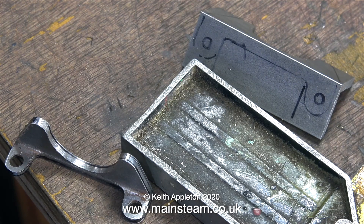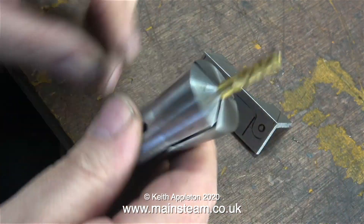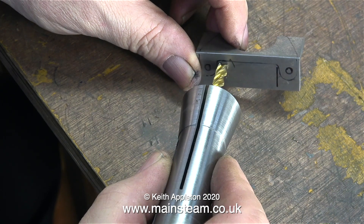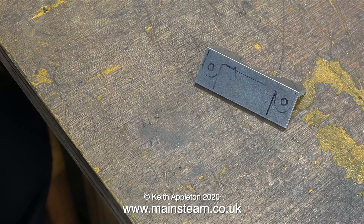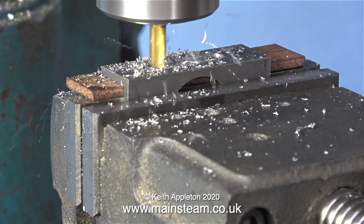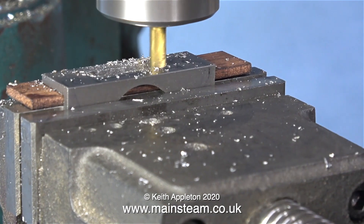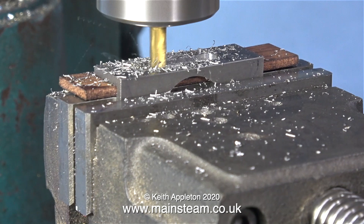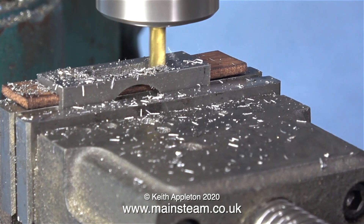On the left is the bracket I made in the last video and on the right is the embryo bracket I'm going to machine a bit more. As you can see, I've drawn around the mounting lugs on the underside. This is another R8 collet to take a quarter-inch diameter cutter. For this job I should use a slot drill which has two cutting teeth, but instead I'm using a quarter-inch diameter end mill which is less brutal. In this clip I'm milling a slot in the piece of angle, and please note that at either end I'm not going all the way to the lines.